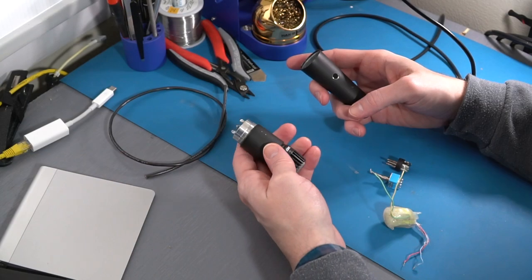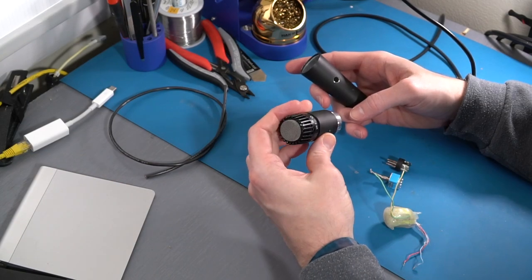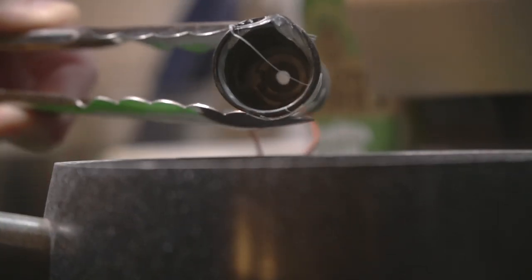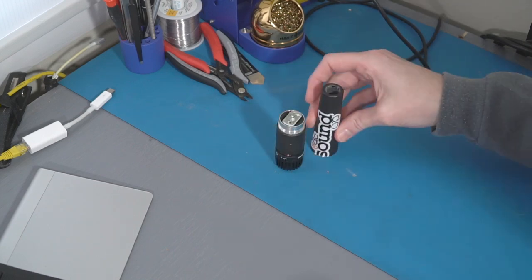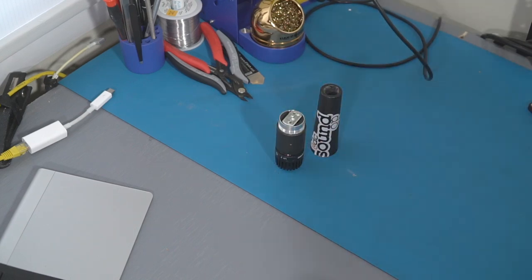Positioning the switch is a major hurdle with this one. The way the handle is cast, it tapers very thin and ends internally about an inch before the bottom of the casting. That leaves barely 2 inches of depth before the threads that accept the element start at the top.